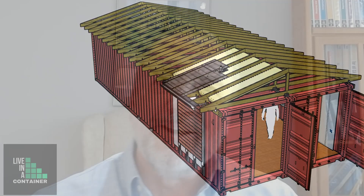Let me know what you think about this Domino Clamp system. It has advantages because it doesn't penetrate through the shipping container, but it is relying on the strength of the bolts to hold all of your trusses in place. With wind loads and all kinds of other lateral loads throughout the years that your shipping container home might encounter, you need to be careful that the fasteners used to bolt these Domino Clamps onto the shipping container will last for a whole lifetime.